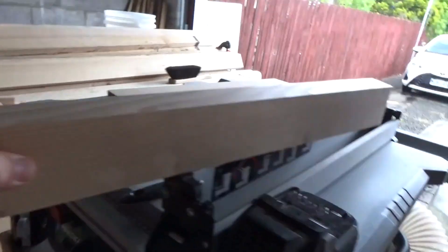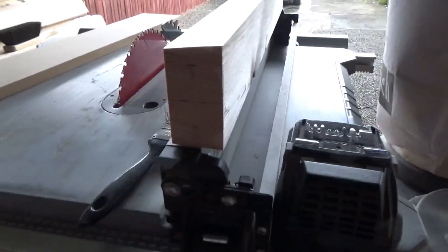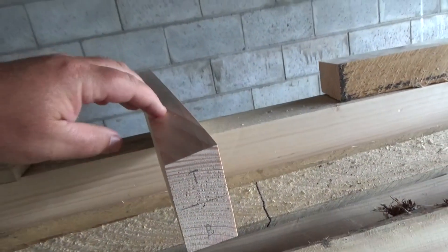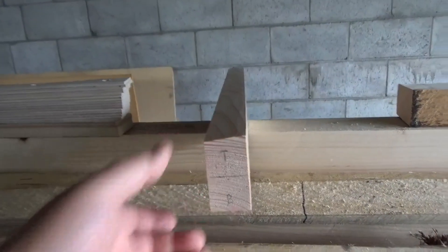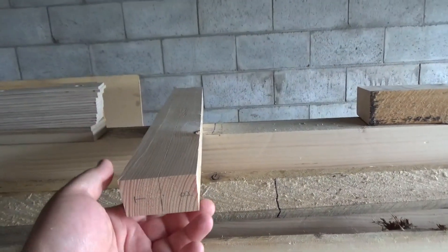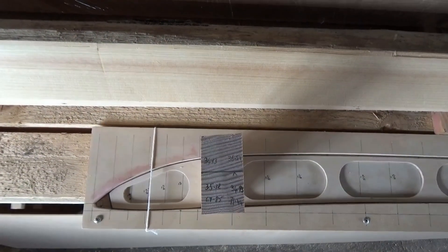This piece I was cutting out for the front spar. The shape's about right, but because of the splits coming to the top, trying to plane those out I end up bringing this down too thin. So I've re-added this to the stack of timber and I'll find another use for it somewhere. I just need to find another piece of timber to mark up for the front spar.